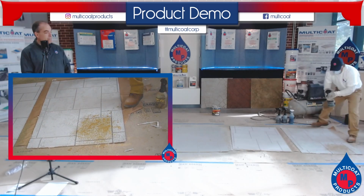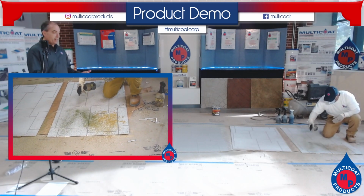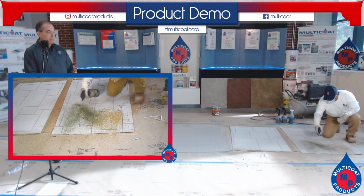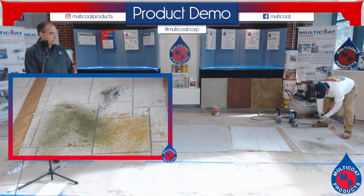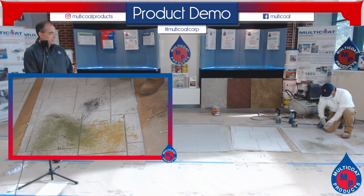And water-based stains are much better than the acid-based stains because you actually kind of know what colors you're going to get. The acid-based stains more work with the lime content in your concrete, while the water-based ones have pretty true color depending on which colors you pick. So what Alfonso's doing here, he's just spraying a couple different colors.